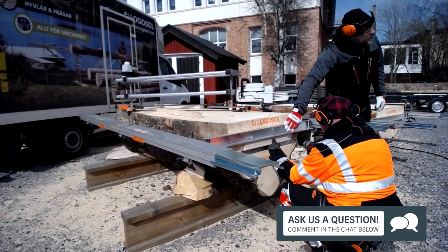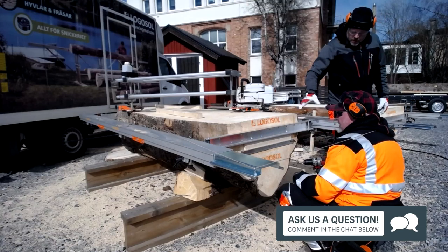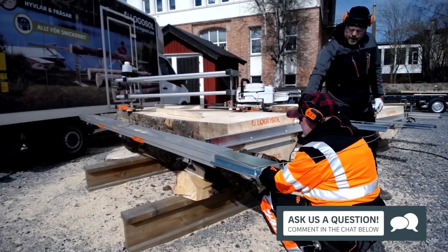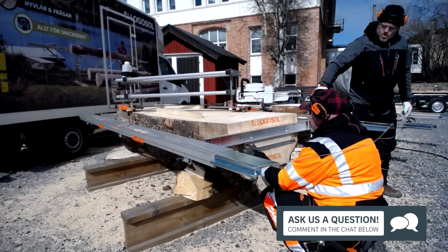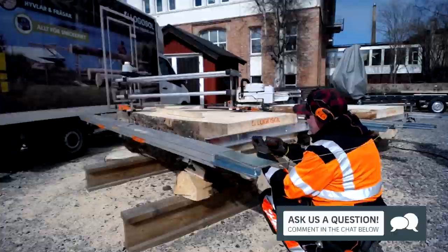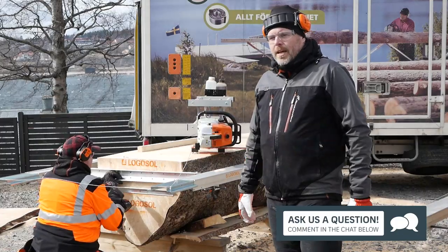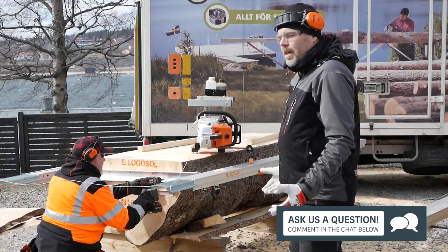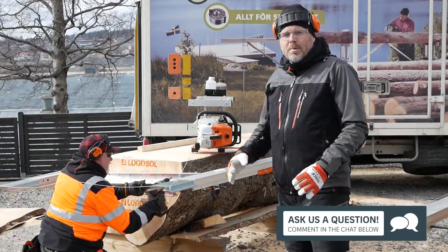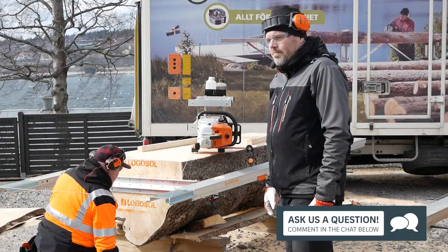And he attaches a plate underneath. So the only thing you do then is you let the horizontal guide here just drop down to the next level. So depending on the types of templates you're using, you can mill all different types of thicknesses. So if you want to mill like 10 millimeter boards, it's possible to do that. I hope that answered the question. You can mill as thin as possible, but it's perhaps not optimal to do that. But it's up to you.